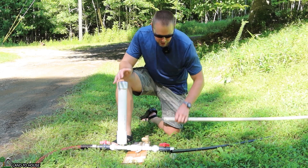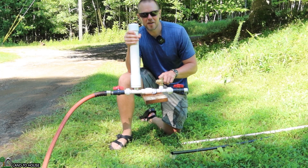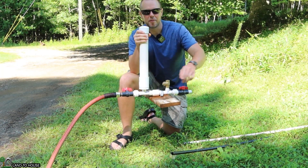Basically, water is going to come down a pipe, enter the pump, and activate the waste valve, which then sends a pressure wave into the pressure tank — and that's what pushes water uphill.